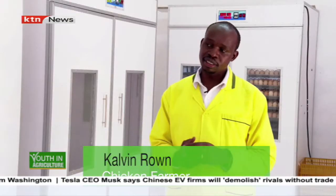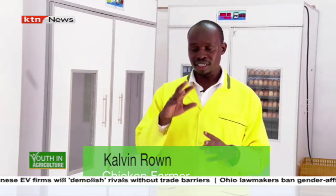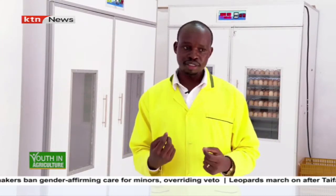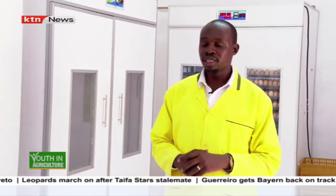Wow. But again, you really need to service your machines, because sometimes you might set the machine at the correct temperature and humidity, but you realize that the internal humidity is less than what is set. So you also need to evaluate. You must have a thermometer, these gadgets, to also measure the internal humidity and temperature.